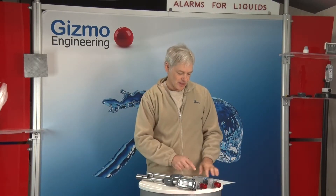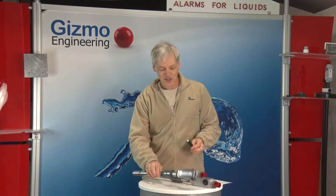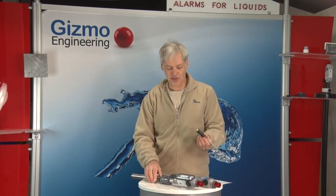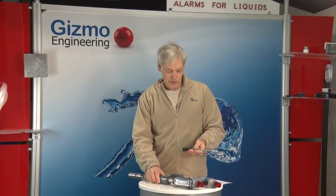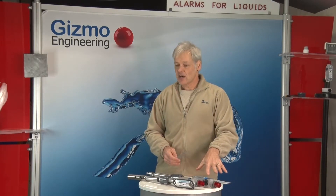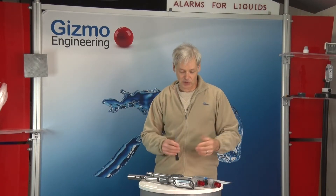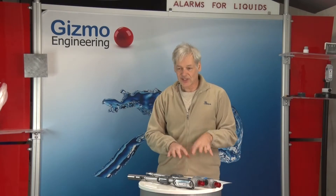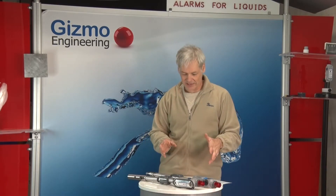The default mode is the 30 minute snooze alarm. There are some relay behaviors too. This device connects to a PLC or through an intrinsically safe barrier to other devices through a circular connector. The mating part goes on the outside of the conduit body and you make your connection that way. With the relay connected, there are different behaviors. There's a delay mode, so you can have a local alarm, but then maybe after 15 minutes, if nobody responds, you can have it sent to a building alarm system. We also have a mode where the alarm auto-resets when the level corrects itself — the light, buzzer, and relay all reset automatically — or you can require an operator to push the button.